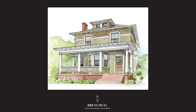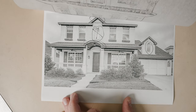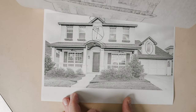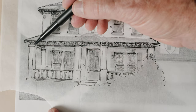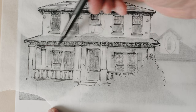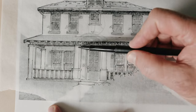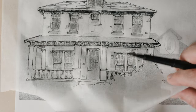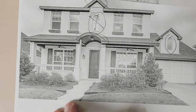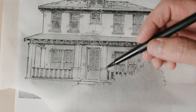I fixed the columns a little bit. I don't like these hardy columns where they just throw trim together to look like it's panelized. I would make these bigger - I'd probably make these from brick. I would put a cap above. There definitely needs to be an entablature that runs across the top. I've put pedestals here around the door to highlight the fact that this is your entry. I've made the door bigger - this looks like a 32-inch door, and I put a 36-inch door to make it look better.